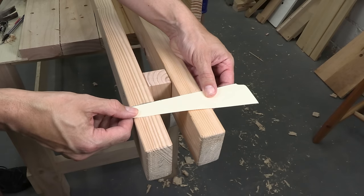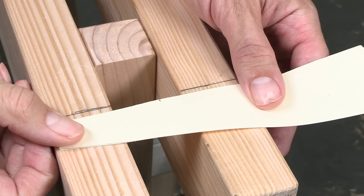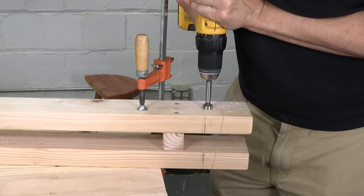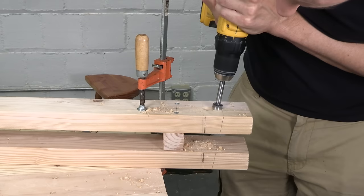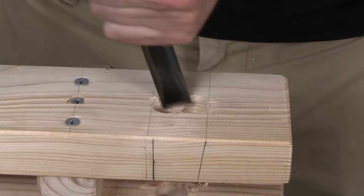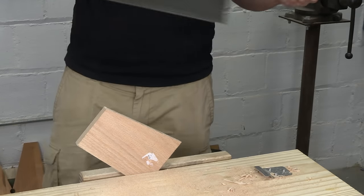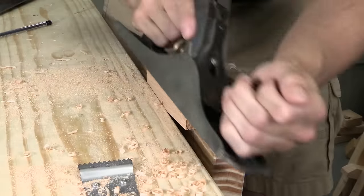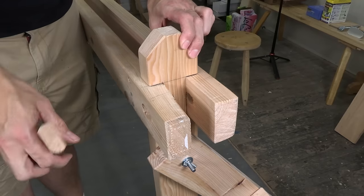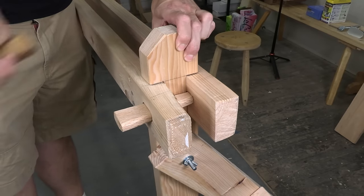The wedge and the angled mortise seem difficult to cut, but they're pretty easy. I've got the leg location marked on the bed, and I've cut a paper template to a 1-in-7 ratio — that's a nice taper for a wedge. I move that template a little bit inside my leg location and trace it. I make the mortise by drilling two holes, one straight down and one following the slope I traced into the wood. A little bit of chisel work finishes the sides. After I rip my wedges and clean up the faces, I'll use the plane to round over the corners of the wedge until it matches the radius of the mortise. After a bit of fine-tuning, the wedge slips right in, and a few taps tightens it up for a solid connection.